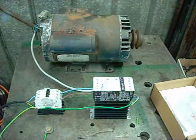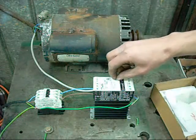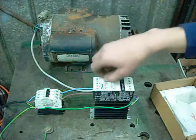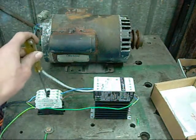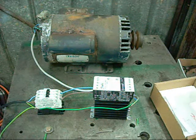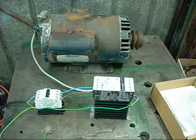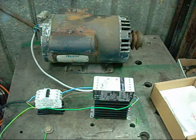It's a bit reluctant to start softly but that's just because it's a single phase motor — three phase would be a lot smoother. Maximum ramp up torque but maximum ramp up time: it's still delivering maximum amps even at low volts, this thing just jumps to life, but that's because it's cap start and cap run. On a normal induction motor with no capacitors it would be even slower on the start-up.